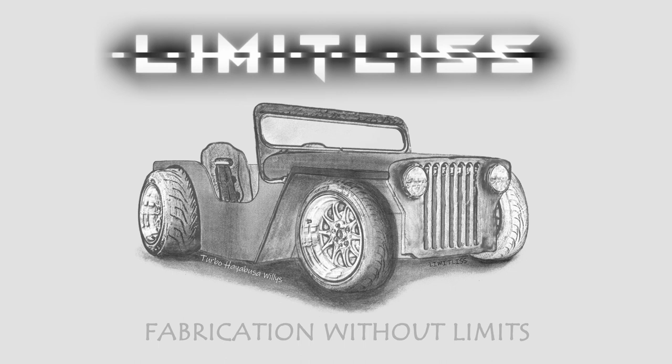Another thing I think you guys would enjoy seeing is I got a sketch done for kind of how I picture the end product. So I'll put that up now. And you guys should be able to see, I use the actual style of wheels that I'm going with. Pretty limited for options. I'm stuck with a 16-inch wheel, pretty much guaranteed. I can't quite fit a 15-inch, and I need a 22-inch overall diameter on the tires. In the sketch you can see it looks like the back sticks out further than the front. You know, I'm not the greatest artist, so in reality they'll both be the same. I might put the back out an inch further. I haven't decided yet. Probably gonna keep it both at the same width.